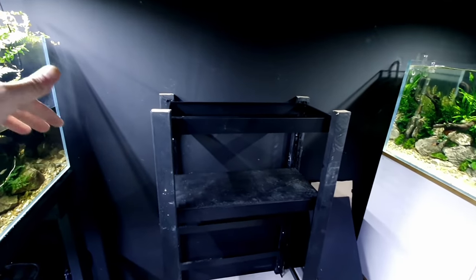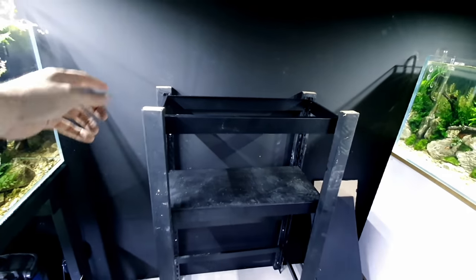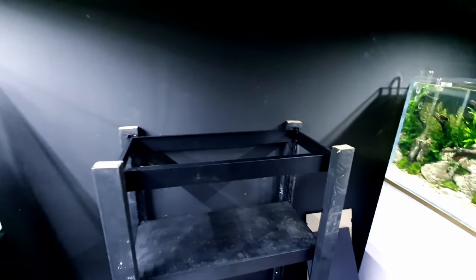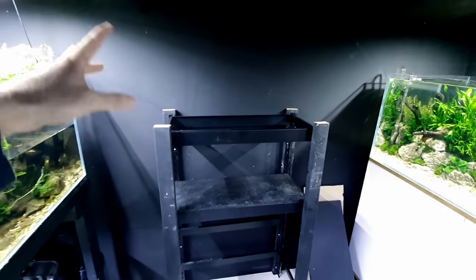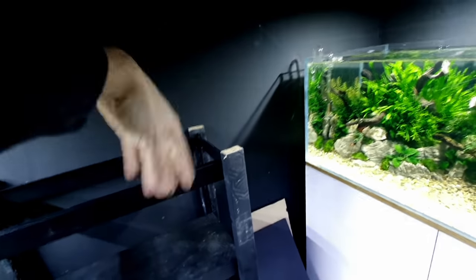Okay, that's all four corners sort of strengthened up. Look, that thing's solid now. But as an even more of a precaution, I'm gonna take some big long screws, go all the way through those back bits of wood into the wooden structure of the whole shed, whatever. Then after that, we can get some cross members on the top. And I think we can bring it all the way around down here as well. So we can have one this side, one there, one there, one there.